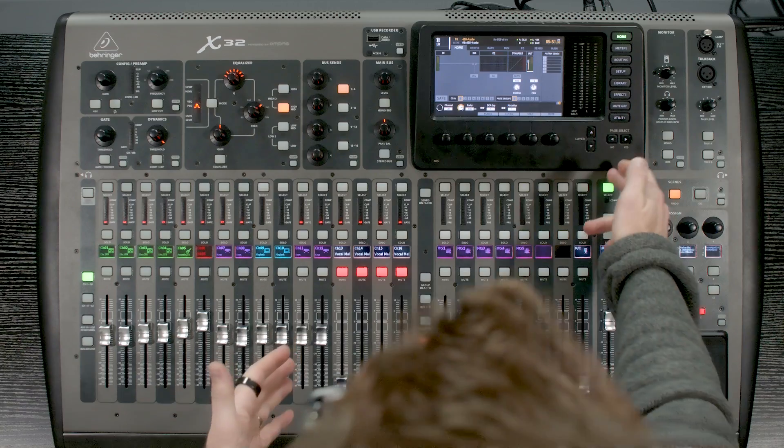Another example is if our PA is too bright — it has too much treble. The downside of having too bright a PA is that your mix, when you plug headphones into the side of your X32, is going to sound dark. And if you're feeding a stream with that mix, your mix on the stream is also going to be dark. If we go to our left-right bus, select our EQ, and adjust the brightness of our overall mix down to make it darker, it's going to sound fine in room, but anything else we're feeding with this mixer is then going to be dark — and that's something we don't want.